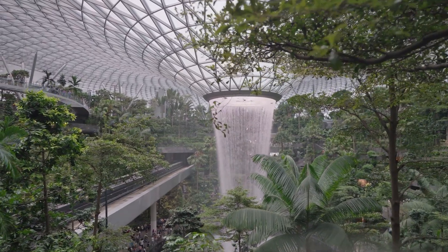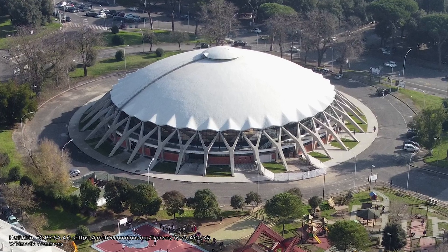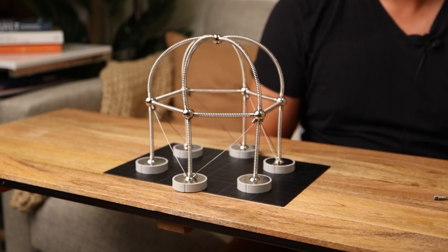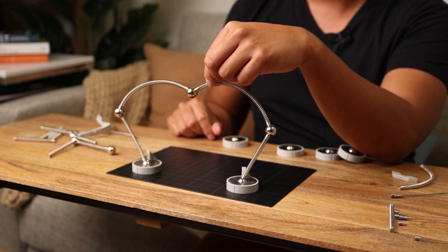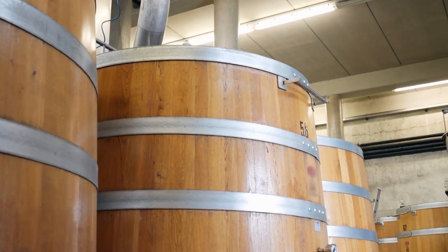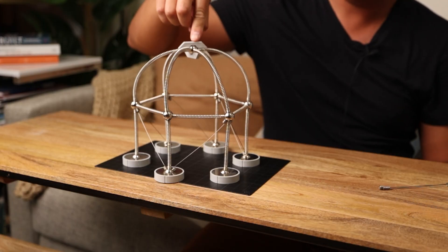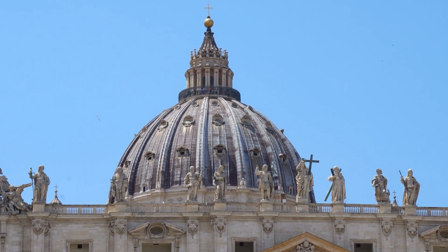That's why you can find these shapes in some of the world's most iconic structures. What about those spherical dome-like structures found in older and even ancient buildings? For example, if you have enough MOLA kits, you can build the sports arena in Rome, the Palazzetto dello Sport. Domes are just three-dimensional arches. With domes, their weakness is that they want to thrust outward or bulge out when loaded, and if not supported, they'll fall apart. The Palazzetto solves this by bracing it with Y-shaped buttresses. But a more structurally efficient and economical solution is to form a tension ring around the dome to keep it from bulging outward, similar to those metal rings around a barrel. This was actually done in St. Peter's Basilica when its dome began cracking in the early 18th century — Vatican engineers tied several iron rings around the dome to prevent it from collapsing.